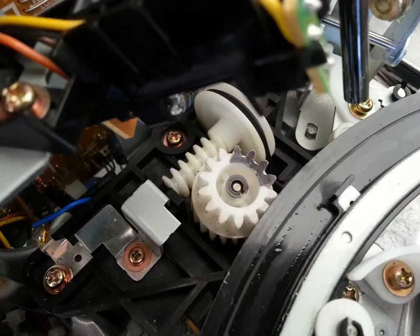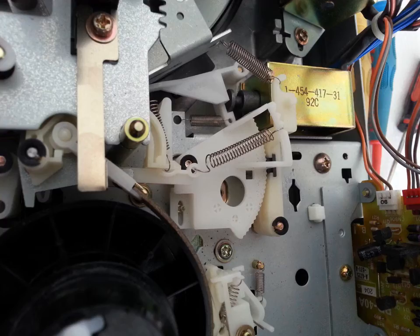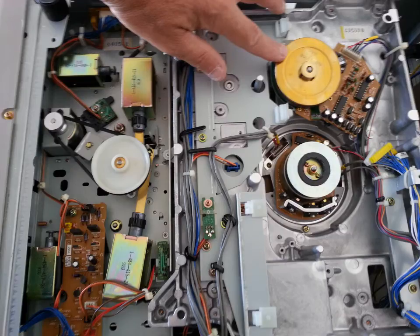It's a very cheap machine. The quality isn't as good as some of the older 3-quarter U-Matic machines — they slimmed them down. They did improve the video by putting a time-based correction card on it, which is a plus, but they made the machine much cheaper overall. They started using many more springs to make connections for various mechanisms, and the springs would start to stretch or wear out, causing certain mechanisms not to work. Replacement springs for these machines are kind of hard to get.